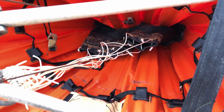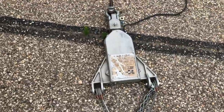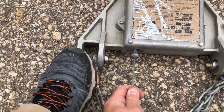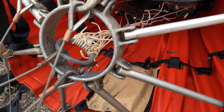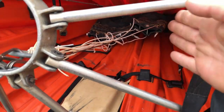In the bottom of the bucket we have the udder, which is held up by laces connecting to a line that runs down into the head. The head has a solenoid inside it. At the moment it's locked, but when I press the button to release the water it fully unlocks, releasing one of the lines connected to the udder. The pressure of the water then pushes the udder open. That's basically how the bambi bucket works.